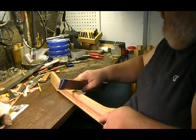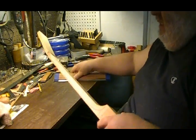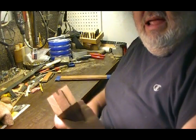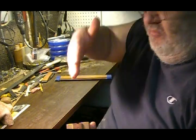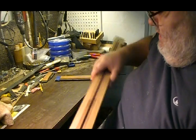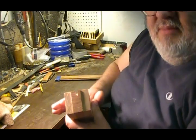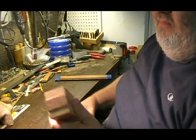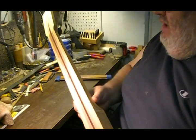I'm going to start at this side and work my way all the way around to the other side. If you can see the end grain on this wood, you'll notice that the grain is fairly vertical, but the grain also has a bit of a contour where it is wide at the top — up near where my fretboard's going to be — and then narrows down either way to bring it kind of to a V. I chose to go that way because it really makes for a nice grain pattern when it finally comes together.